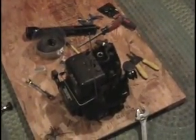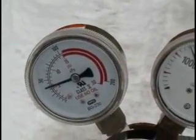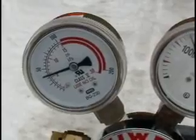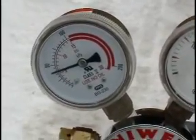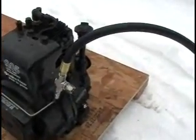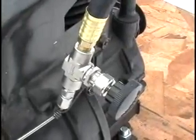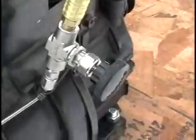We'll get back to this again tomorrow, which should be the day we fire it up. I also went ahead and changed the low pressure regulator to one that starts at 1 PSI and works its way up to 5 PSI rather slowly, so I can better control the flow of gas. I have a hose coming out of the gas, coming over to here — about six feet away is where the mower engine is, and I wanted to keep it at a bit of a distance. I trimmed that 1/16-inch stainless steel tubing and attached my Swagelok valve to it. That's what controls the final amount of gas that goes into the motor.